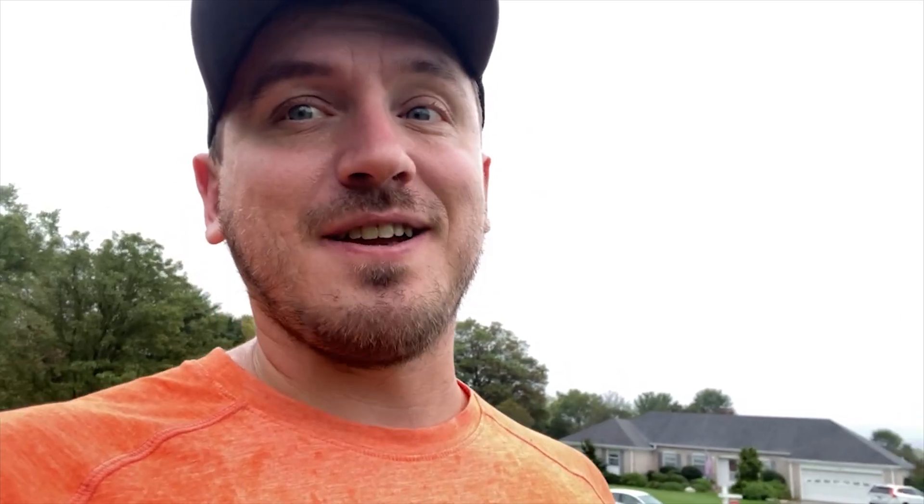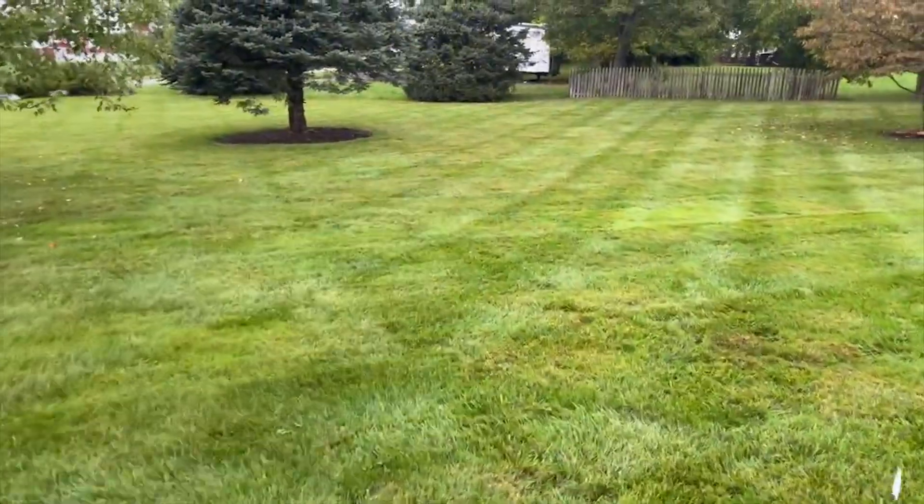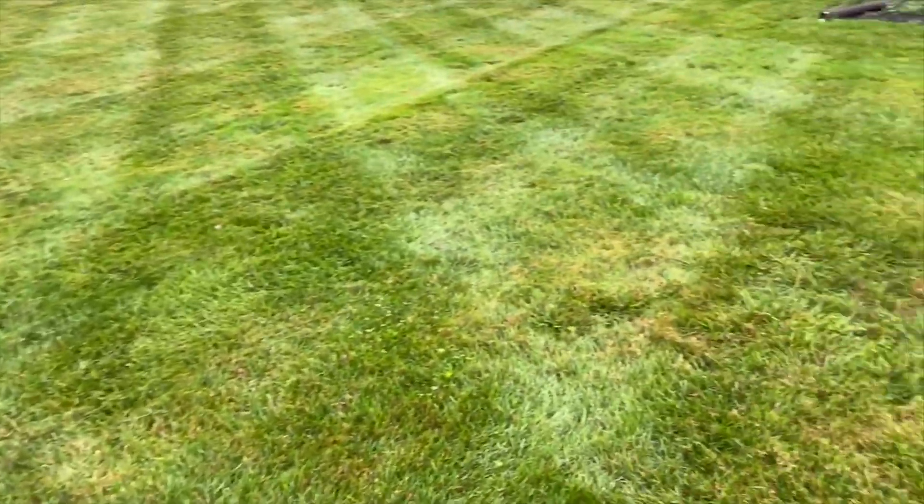The next step is to probe out the drain fields. We've discussed drain fields on this channel — basically that's the absorption system. We're running water through the tank right now to make sure everything's flowing the way it's supposed to, but it's also very important to check the stone: is it dry, is it wet, or somewhere in between? After probing for a bit we found the two drain fields on that side and the one on that side. These drain fields are dry, which is great and kind of what we expected for a home from the 90s.